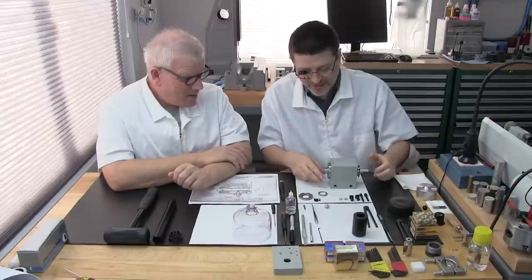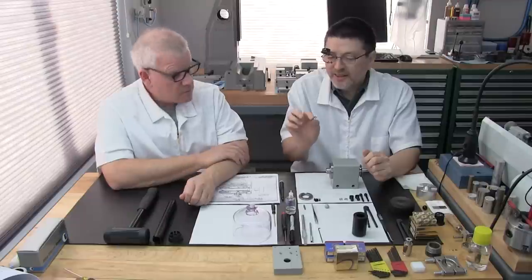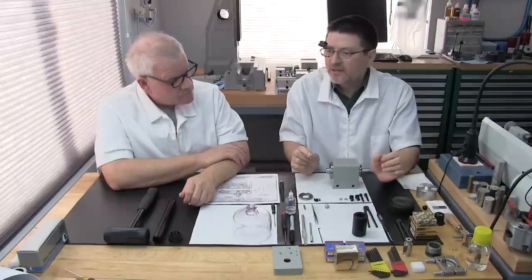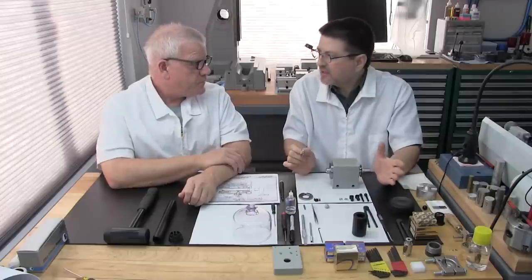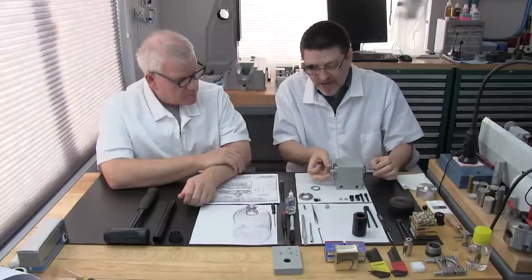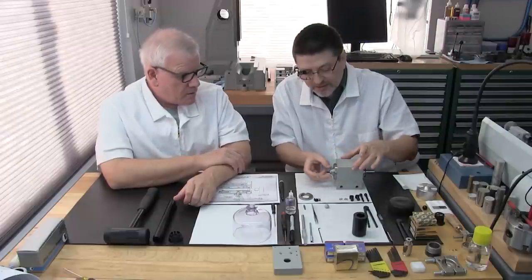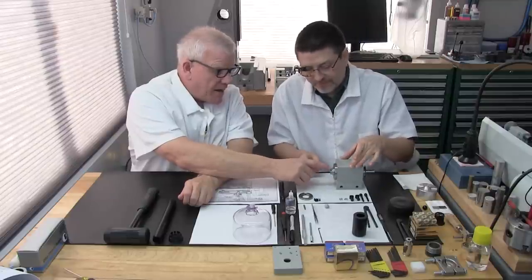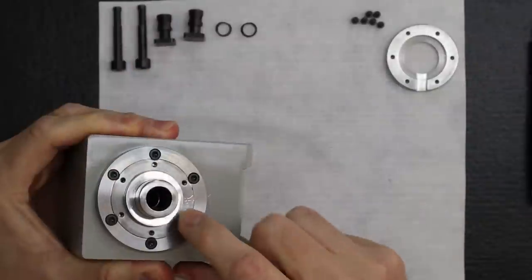Now that's a soft aluminum part there. You have to be really careful installing this because it's really thin, soft aluminum. There are two ways to install this. One way, which we don't really recommend, is to use a socket from your socket set. Select the size that's just slightly larger than the diameter of the spindle head. You put the slinger on snug. It can't be too much bigger, because the whole body of that slinger that needs to go in that slot needs to be pushed from the side nearest to the spindle.